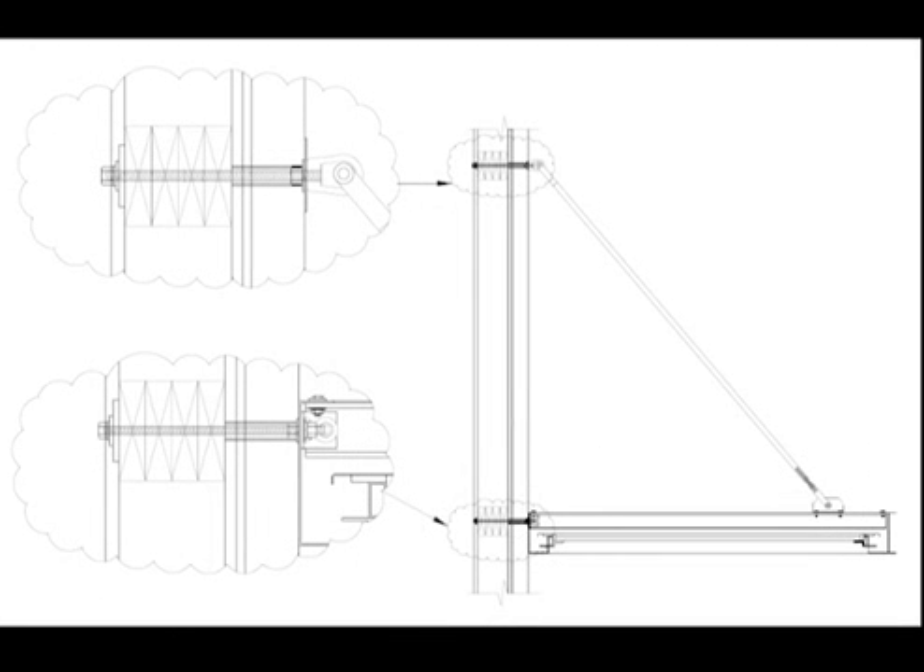Now, let's talk about connecting to a frame. Typically, we see light gauge steel with a dense glass cover. This one gets a through bolt with blocking and a compression sleeve. We'll talk more about compression sleeves and exterior preparation in our next video.